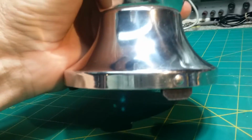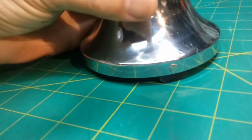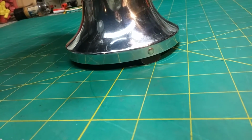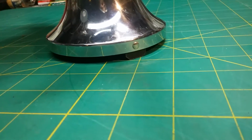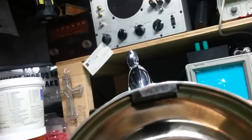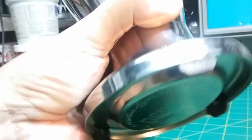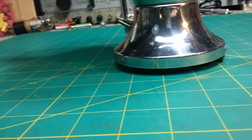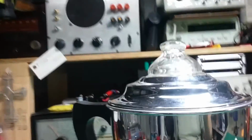Of course, the rivet had to be drilled out of the old one. So we drilled it out from behind, but we didn't drill all the way through it so that we could actually reuse it. We epoxied the new leg to the inside of this rim using 2-part epoxy. And then we put the rivet through it, even though we couldn't crimp it anymore because we had to drill it. But we put the rivet through it, and we epoxied the rivet in it for extra stability. So it is super strong, and no one's going to know. It looks like the original leg, so no one would know without actually investigating and checking it out.